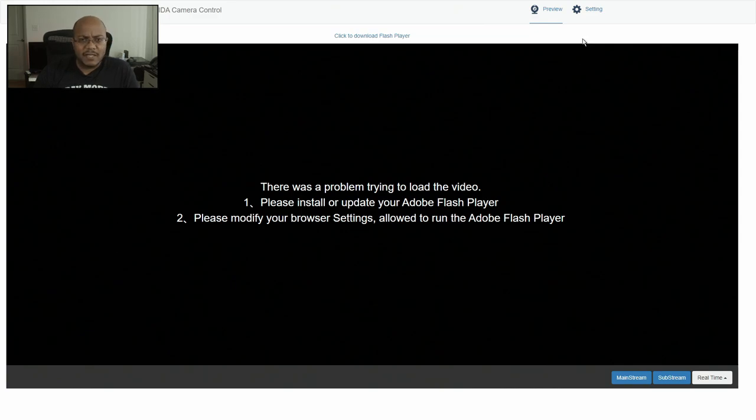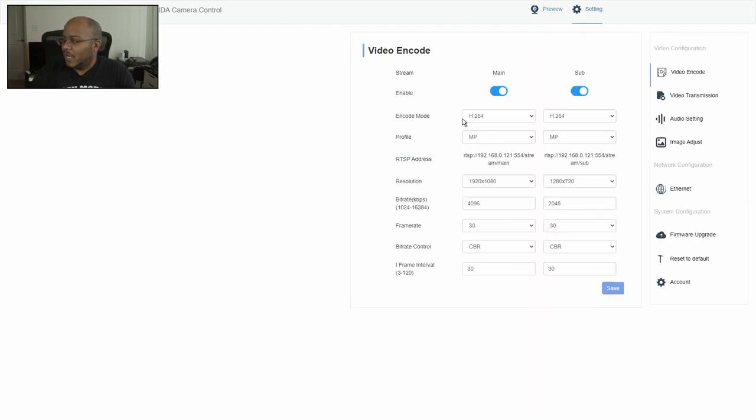Let's check out the settings. We're coming from HDMI — that's where you saw the video we just did. Under settings we have a lot of things. In video encode you have a main and a sub stream. You have RTSP so you can connect directly to it like an IP security camera. The main stream is at 1080p — the highest resolution — but it can go down to 1024 by 576. You can set bit rate and frame rate; this can actually go up to 60fps. Let's crank it up to 60. The sub stream has the exact same settings at a lower level. Let's save that.